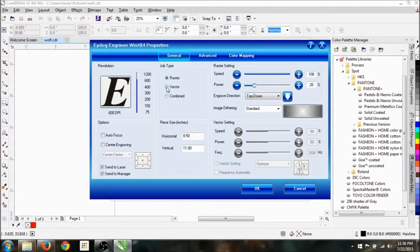For the vector cut, I found this information on the Epilog website — going to do that at 12% speed, 100% power, 5,000 frequency. I'll turn it up because I know it cuts at a higher speed. The problem is that during the cut it curls — the heat spreads very quickly and warps the plastic, although you could just hit it with a heat gun.